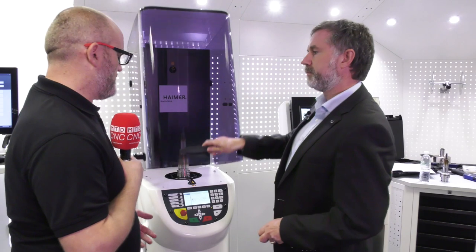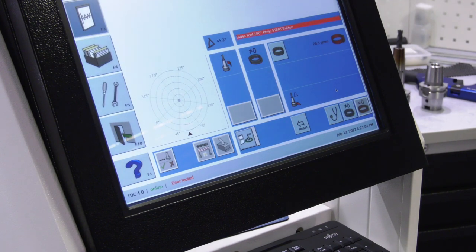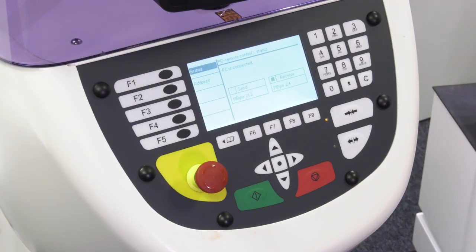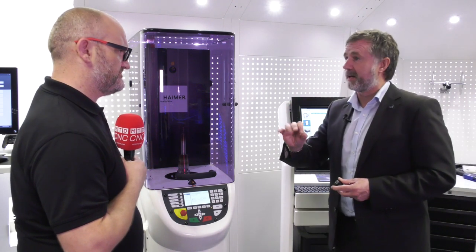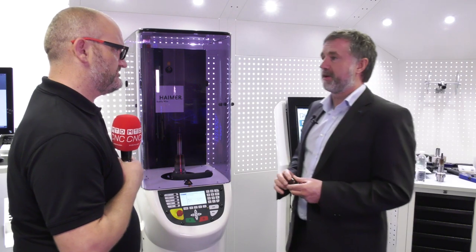So would it be correct to say, when you put a cutting tool in, 99% of tools are going to be out of balance, tooling assemblies? Yes, we often see that. What you're looking for is your starting point to be as good as possible. So the G2.5, 25,000 revs, yeah? But yes, more often than not, you do see an error. So what we've actually said on this is we've asked this tool assembly to have a balance quality of G2.5, and have the ability to run at 25,000 revs. Now at the minute, it's only very slight, but it falls outside that. We're at G2.6, so the maximum revs would be 23,000. So all we're doing is just adding a little bit of weight in a certain position.